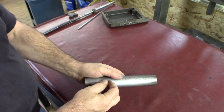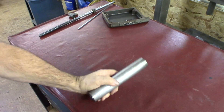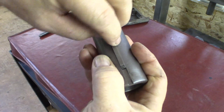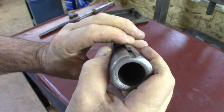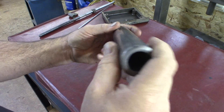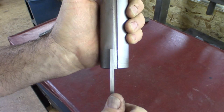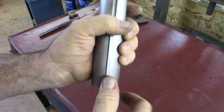When you put it in here you can see how much play there is. There — you can see that, a lot of play, and that's the rocking motion in the tailstock. So I have some three-sixteenths key stock here. There was a little bit of an edge built up along there so I cleaned that up with a file real quick.